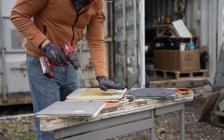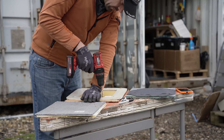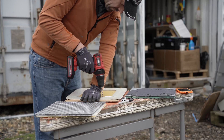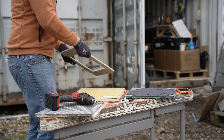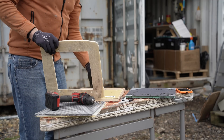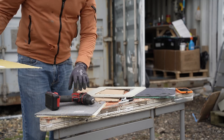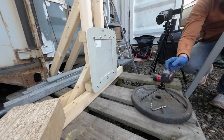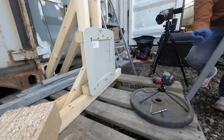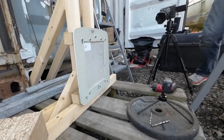I'm making a modification for this second round of impact testing with new plates of different composites. The bolts through the edges clamping the solid fibreglass frame on will be ripping out through the thinner sheets, so I want to spread the shear force across twice as many of them. The only other solution would be to over-laminate more fibre reinforcement around the outer edges, but I hope this simpler addition will help. We stand ready, primed to recommence the banging — sledgehammer ready, slow-mo cameras in place.